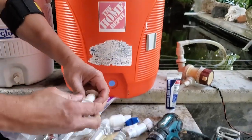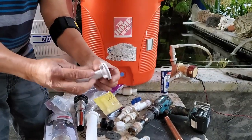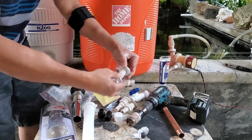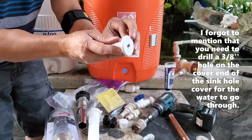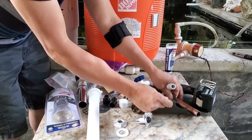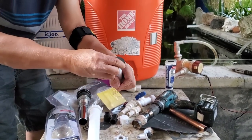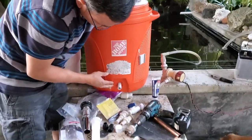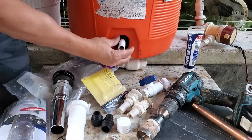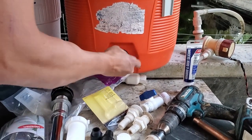You can use this one as the intake valve for your bait tank. You can run to a store and buy the cheap sink hole cover. This hole right here is half-inch, so it's perfect. Inside they have a washer, but this washer is not very good. What I did is I used rubber — you can use a bicycle inner tube — and I cut out a washer. I'm going to double it and put two washers in here, and then screw the cap in. Very simple.